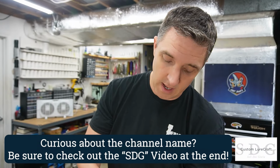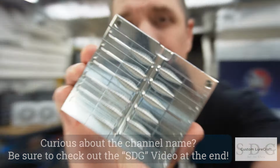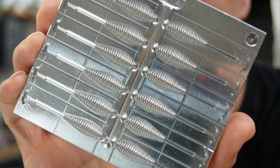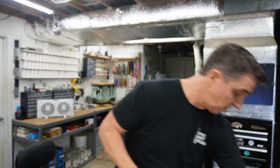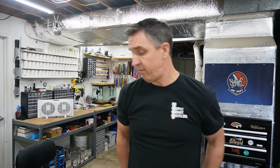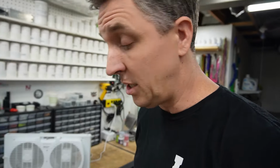You need to be careful when I open it because it's got rods through it for the core shot. If you're not familiar, that's what she looks like. So let's get started, and first thing we need to do, get a half a cup of Plastisol in the microwave, about a minute and a half, and while we do that, we can put some oil on these rods because you need oil on the rods after you shoot the shells so the shells come off easily.